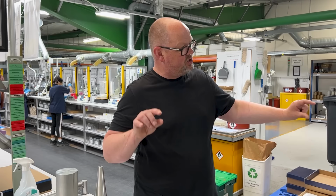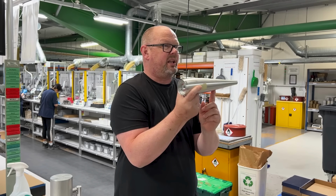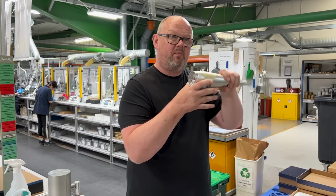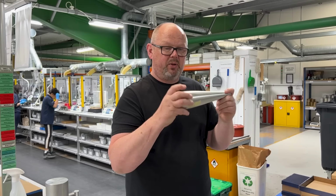Anyway, back on the 800s, the reason we went for the longer tube length is for all those good things. We couldn't do it before, because the longer the tube length becomes, the heavier this becomes. And this is also isolated, or decoupled, from the head assembly that sits below it. In the last generation, we experimented with that, and we found that because of its increased weight, it wasn't decoupling properly. So the breakthrough that enabled this in D4 was an improved decoupling system, the two-point decoupling system.